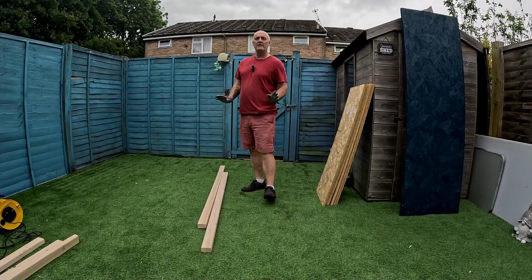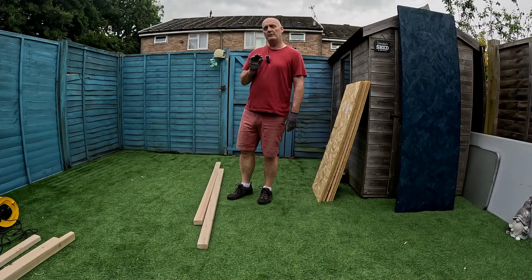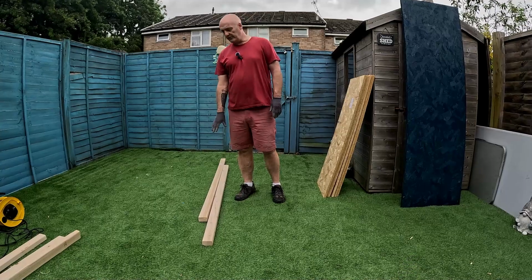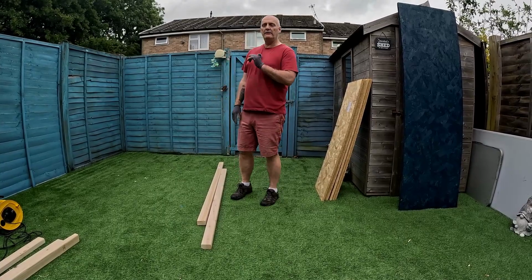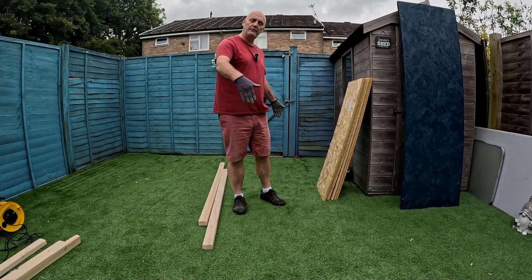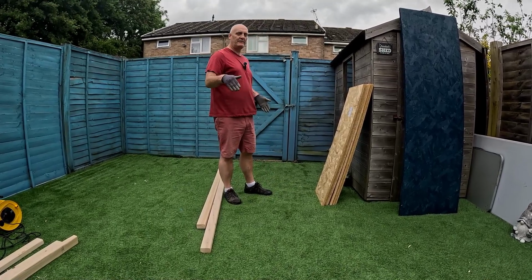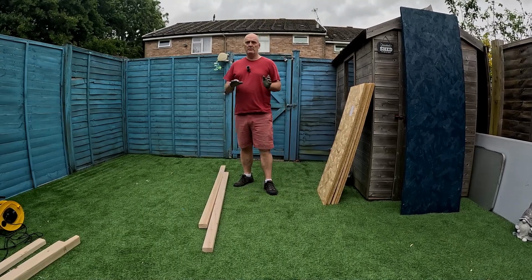So we're going to crack on with assembly of the shed. The first thing you always have to do is make the flooring. Again, I was doing everything to a 6 foot cube square. But one thing you've got to be careful of is that even though I've cut these lengths of wood, when you put 3 of the side panels on the floor, remember I said about the blade, it looks like all 3 panels together aren't quite 6 foot. So I will make the flooring up, then probably have to adjust as we go, but we'll see how it goes.